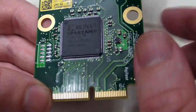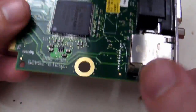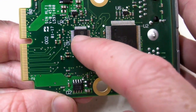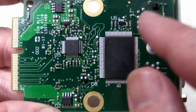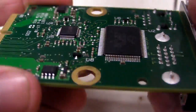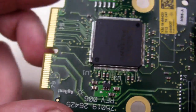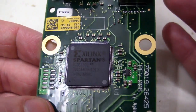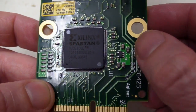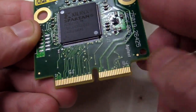And there's a JTAG interface over here for the FPGA, and that's pretty much it. It's just a basic implemented VGA controller with the DAC for the RGB signals — it generates the timing. One thing you'll notice is that there is no crystal — there is no oscillator at all on here. So obviously the timing is coming from the main board, coming from the DSO. That's where it gets its clock from. Why not? Because you save a bit of system cost — why would you bother putting an oscillator on here, which might cost 50 cents, when you can tap the signal straight from your DSO?